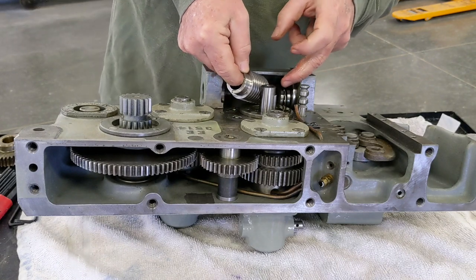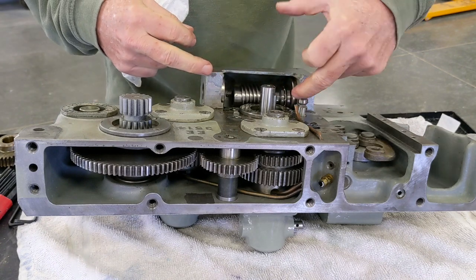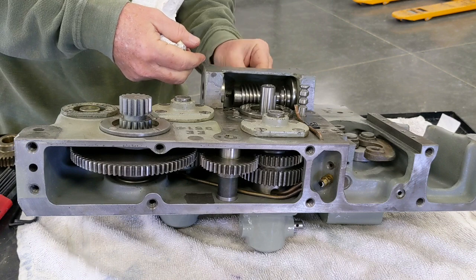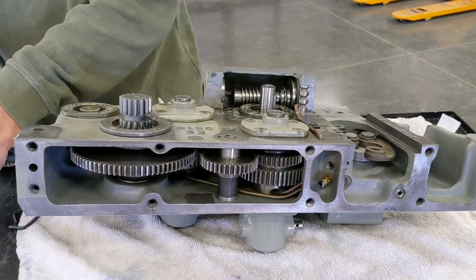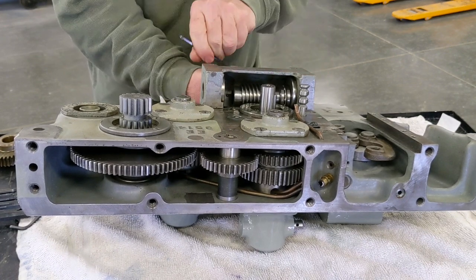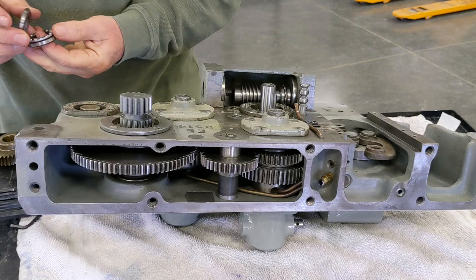This little area is like a little well. When the lubricating oil comes from the pump and drips down onto this mechanism, this well actually fills up. There's a little pipe plug that goes right in the bottom here. I'm guessing that over time the well probably fills up and overflows, leaks out, and just goes down into the sump in the bottom. So I'm going to get this pipe plug tightened in there right now because I can just see myself forgetting that.